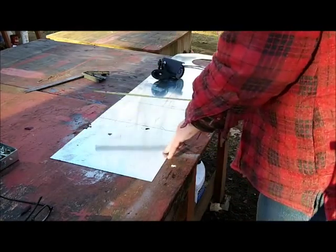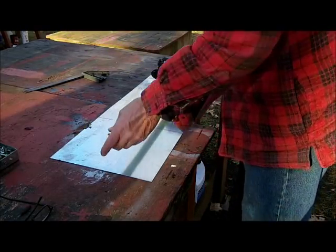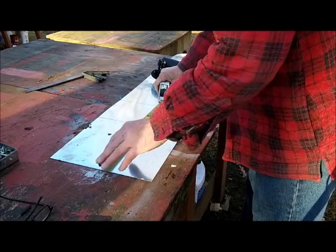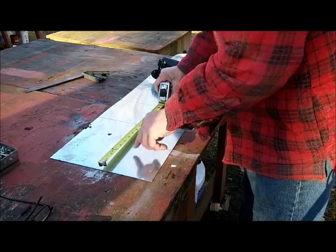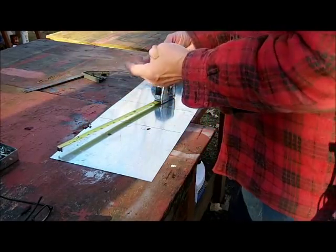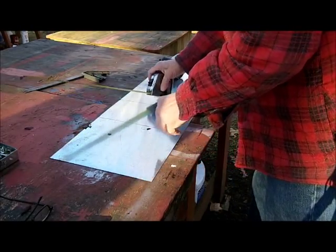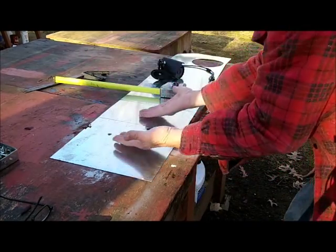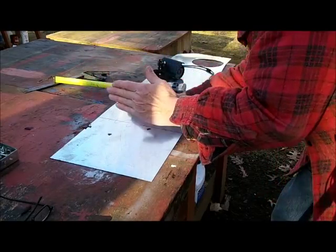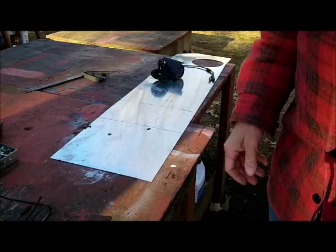this is 10.5 inches wide. This is the sheet metal I got from the sheet metal shop for the bodywork I made earlier this year. And I can get more of it if I use too much of it, but this way, this will give me enough curvature that I'll be able to make a side straight so I can screw it to the fascia board. I was originally going to have a little flange and screw it, but I think we'll just do with a side, cut it here, and we'll roll it so it'll be round like this. It'll be flat on the fascia board side, but it'll be curved like this coming down. So we're going to cut this now, and we'll come back on this video very shortly.